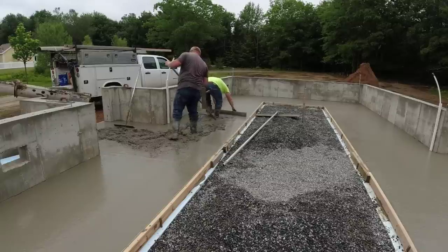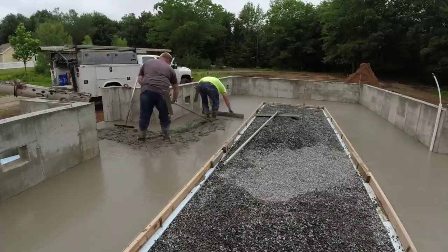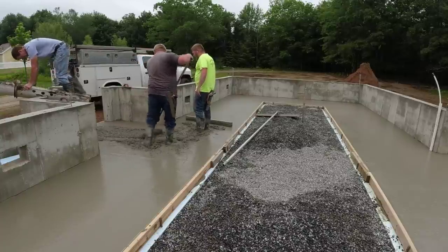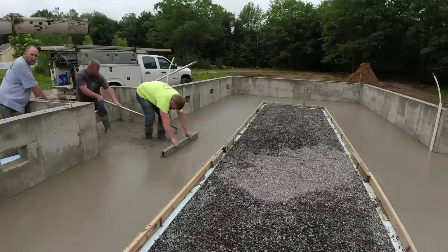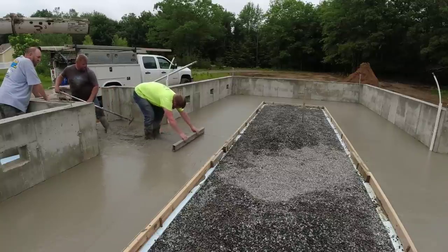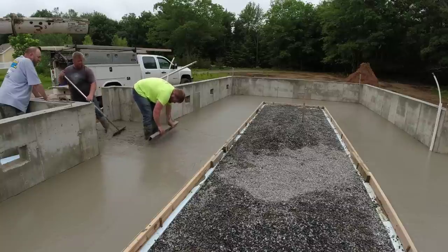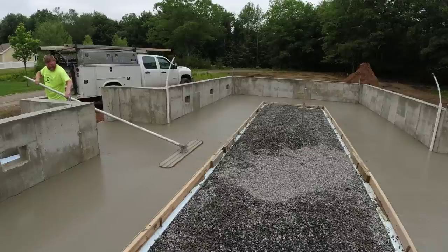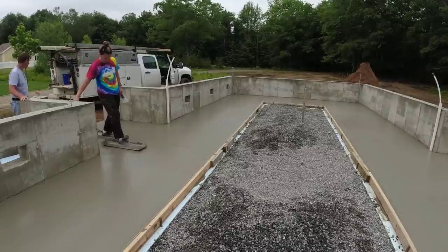A lot of bending over screeding with a small four-foot rod — we're used to screeding with 12-foot or 14-foot rods, not four-foot rods for a whole job like this. I get up there just scraping the chute down using my boot method. How many of you guys scrape chutes like that? Let me know down in the comments if you like my boot method. There's Brian the super driver over there, and Darren's just going to finish it up with the bull float now.